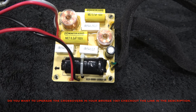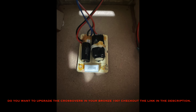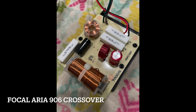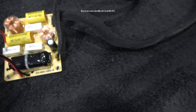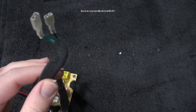The crossover on the Bronze 100 isn't bad for such an affordable set of bookshelf speakers. It's definitely much better than the basic, no-frills, first-order crossover design I found in my KEF Q350s. In my opinion, the quality of the parts on the Bronze 100 crossover is very similar to those used in the Focal Aria 906, which retails for $2,200 per pair. While there isn't anything super fancy here, the sum of the parts seem to work well together. Monitor Audio is using a mixture of polyester film and electrolytic capacitors, along with a mixture of air core and low-loss laminated steel core inductors.